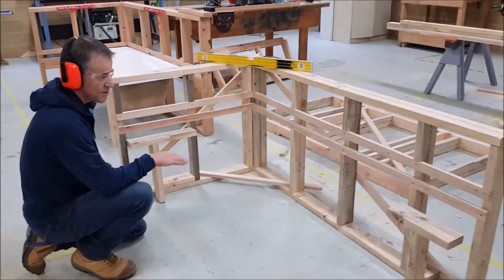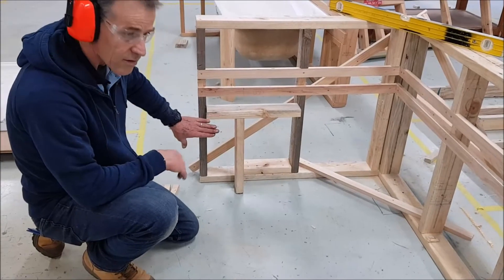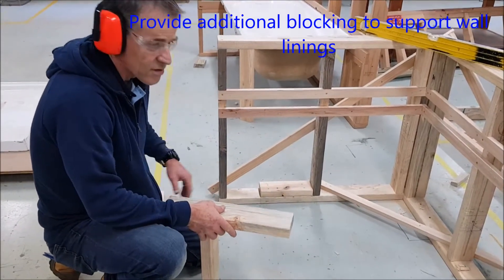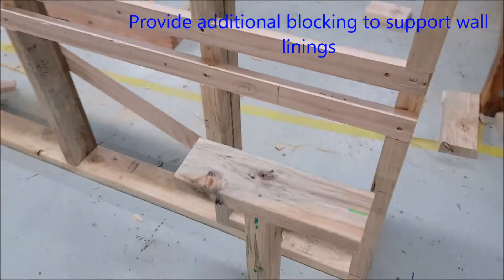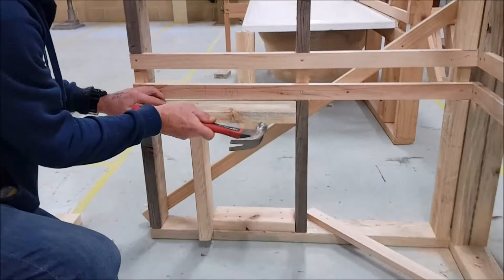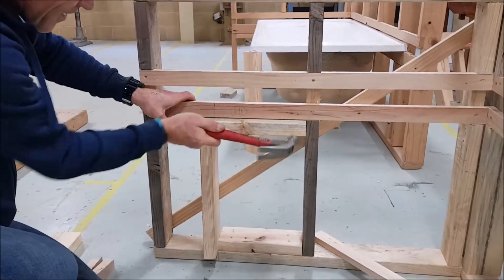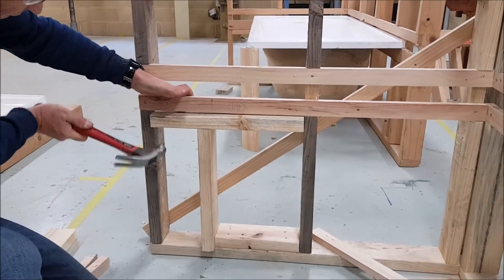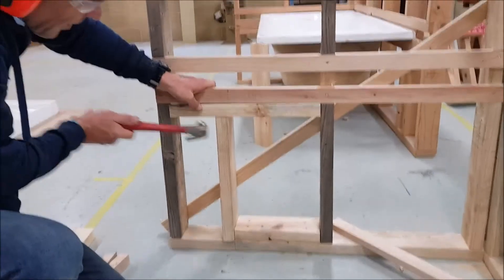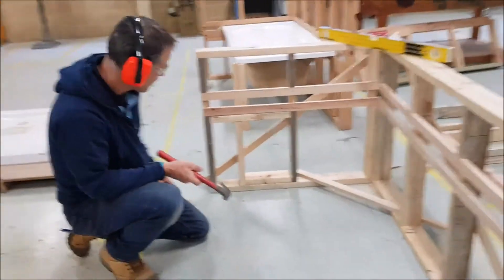For our external frame that sits underneath the bar, we need to provide some framework to support our wall sheet on the outside of the bath, which would be internal of our room. I just put some blocks onto the bottom plate, formed a short stud and a nogging. I'm just going to knock that into position and secure off with a couple of nails. And this can all get done from inside the bathroom like this. See, that's nice and tight — that's going to be great support for what's about to happen. And likewise over there.